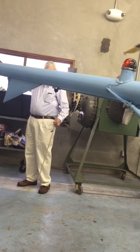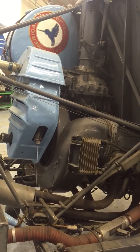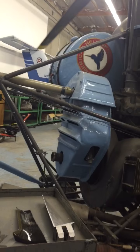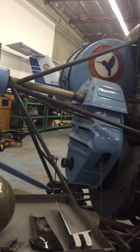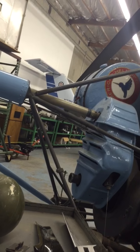You notice that the drive shaft for the tail rotor is spinning much faster. The tail rotor is so much smaller — to generate enough force, it has to spin a lot faster. So it's geared, I think about 10 to 1: about every 10 rotations of the tail rotor for one rotation of the main rotor, to get the right amount of thrust. The main rotor is limited to somewhere typically around 300–400 RPM just because of tip speed limits.